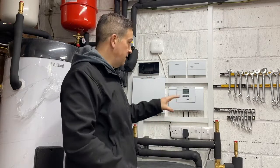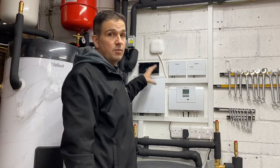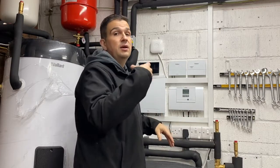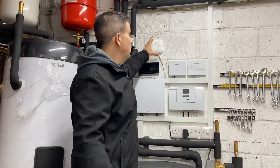We've got the Senso Comfort, which is the main control where you set up all your parameters for the heating system — the heat curve, the temperatures you want to provide, what's going on with the hot water system, and flow sensor temperatures as well as the outdoor temperature sensor. You can also use the Senso Comfort as a room thermostat. If we hadn't had the Nest in place, we would have used the Senso Comfort for one of the heating zones internally.